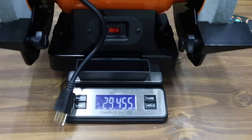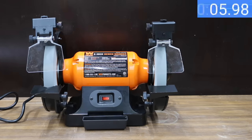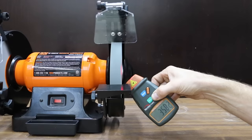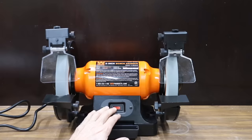Later in the video, we'll compare the quality of the tool rest, spark, and debris shields. The Wynn weighs 29.45 pounds. They claim their motor offers quick start-ups, and it takes 8.4 seconds to reach full operating RPM at 3,583 RPM. The Wynn doesn't make too much noise at only 65.6 decibels, and it takes 2 minutes and 20 seconds for the wheel to come to a stop.